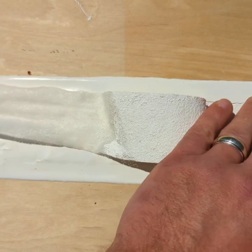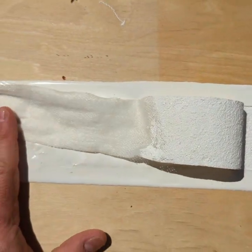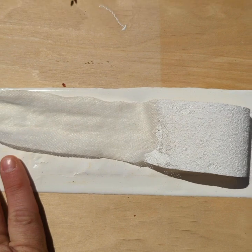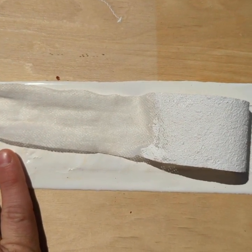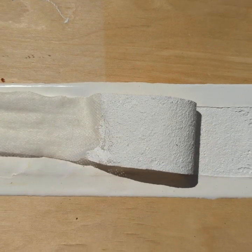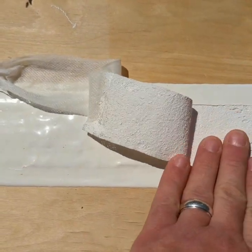Now, if you have total adhesive failure, if the coating comes completely off, then that number on the fish scale becomes very important, because the ASTM standard is that you need 2 pounds per lineal inch of pull if you have adhesive failure. So both of those numbers are important and should be recorded, but the most important of the two things that you record is cohesive failure.